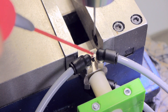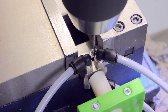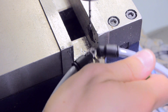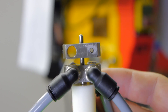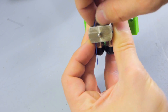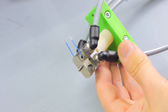So back to fixing it. I went with installing an axial thermistor with glass fiber sleeving, which I think is the most robust way to get a thermistor into a heater block, period. The stainless used for the OPAM block turned out to be extremely easy to machine, so if you run into the same issue of the thermistor breaking, I'd highly recommend doing the same mod. While I used a cheap MF58 thermistor, which has been working great for me in other hotends and for normal use, you can install any other axial thermistor in the exact same way.